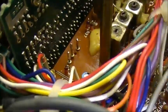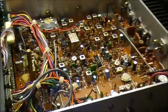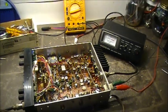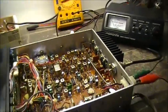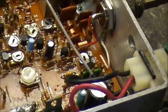The radio was modified at one point — I removed that modification, so she's no longer modified. Just a little update on the AR 3500: AM full power, FM full power, CW full power, SSB very low power. What do you folks think — have we got a bad set of finals, or is there something more sinister going on in the transmitter section? Something more sinister, possibly.